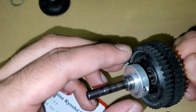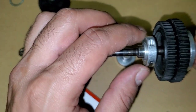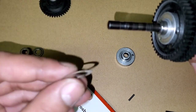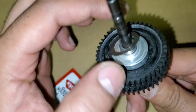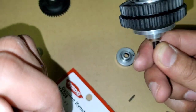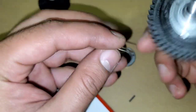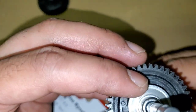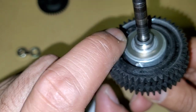Make sure we're not missing any washers. That goes in like that, and then you've got the shim I took out earlier — a super thin shim. Be very careful with this. I kind of smashed mine when I was taking it apart — it got elevated on one of the pieces and I put the other gear down and smushed it. I had to flatten it out, but it's still doing its job. It should be laying perfectly flat.